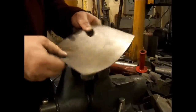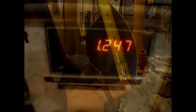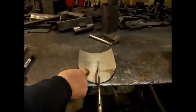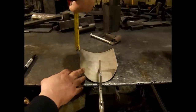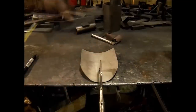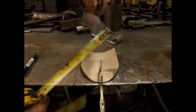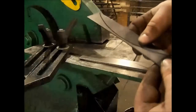The next step, after we fabricated the shovel head and concaved it, is to put it in the vise. We want to measure for the foot pad — simple: 1¼ by 6⅝ of an inch long. Let's go ahead and work on the foot pad on the back side. We're going to need to clamp the shovel head to the table and make sure that it's level — 1¼ each side. Take the strip we just cut, 6⅝ by inch and a quarter, and place that behind the shovel head. Take a sharpie and scribe. Let's go ahead and snip this off.